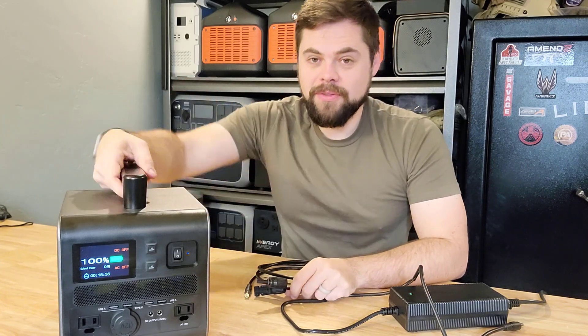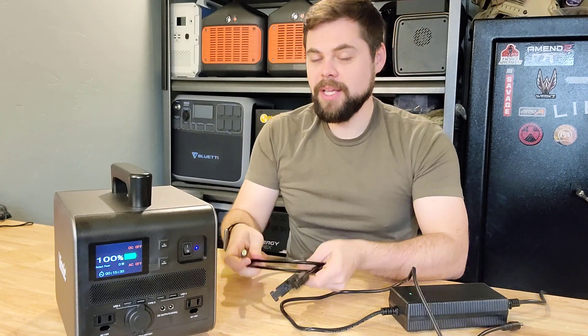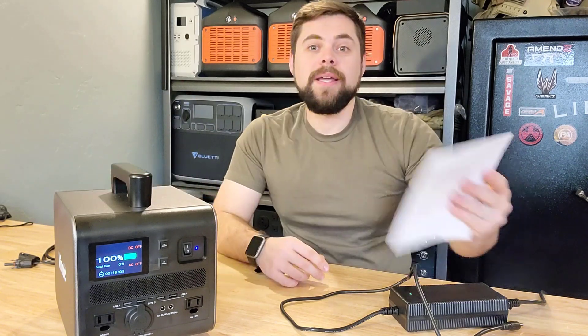The Jackery 2000 and 1500 have an 8mm large pin and require a special adapter that only Jackery supplies. As for the Vinic, I'm not sure what kind of adapter it'll actually come with — I didn't know I needed to order it separately. But the bottom line is hopefully this works. This unit has a 500-watt pure sine wave inverter, about a 500-watt-hour battery, peaks at 1,000 watts, and can accept up to 200 watts of solar input from 12 to 30 volts.